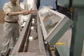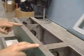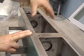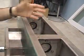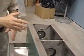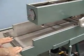And then we have an exit tank. Now this tank, even though it gives us another 12 inches of cooling, really the purpose of this tank is to create a vacuum seal on the exit end. So if we suck anything in, we'll suck in water and thus not air and no turbulence. Then we have an 8-inch drip dry section for the part, and if the part was still wet, the rest of the water would be caught in the catch pan. Okay?